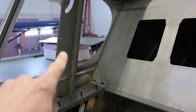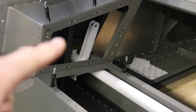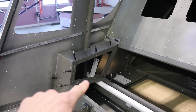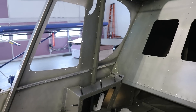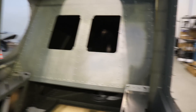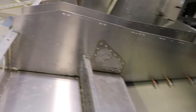There's another piece here that I'm not putting on just yet because I still have to add the bell crank that'll get bolted to this white piece — there's a bell crank there for the aileron push rods. I still have to hook up the flap motor yet. When I put that bell crank on, there are push rods that go all the way up to here and those have to be inserted before you put on these other aluminum pieces, or you'll never get the rods in there. Those are the push rods that I painted. So I can put the bell cranks on, put the push rods in, put in the other aluminum pieces, and then I think I can go through and just rivet everything.